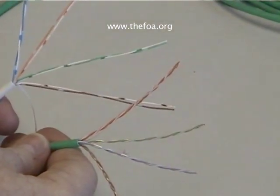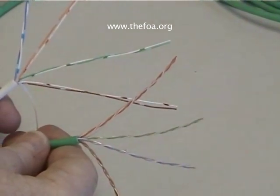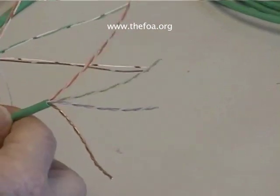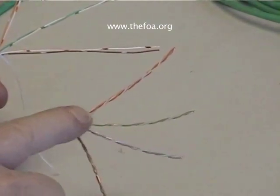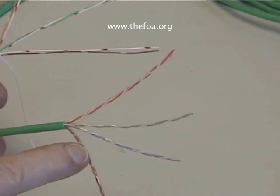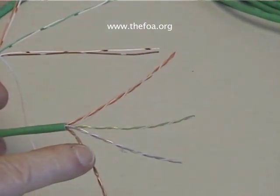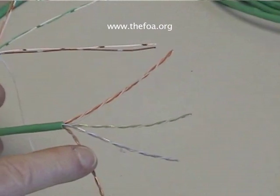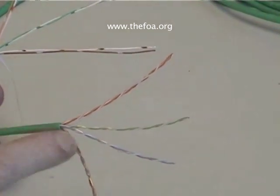When we take telephone wire or Category 3 wire, even if we're going to use it up to 10 megabits per second for ethernet, we don't have to worry about being as careful with the twists. But with Category 5, in order to maintain the performance of this cable, it's necessary to maintain this very tight twist to within one half inch of any termination. We have to be very careful about that. If we don't maintain that twist right up to the termination point, we destroy the performance of the cable — it causes reflections and crosstalk, meaning the cable will likely not work well when we try to run fast ethernet at 100 megabits per second or gigabit ethernet.